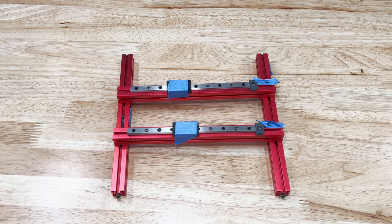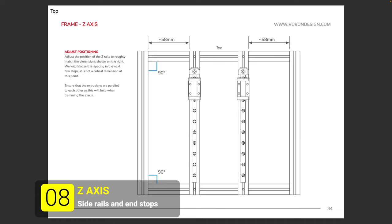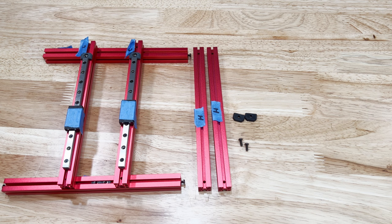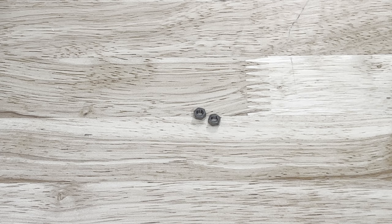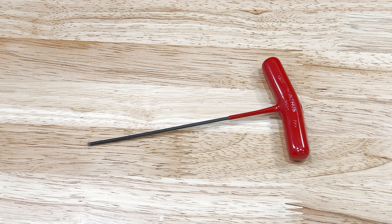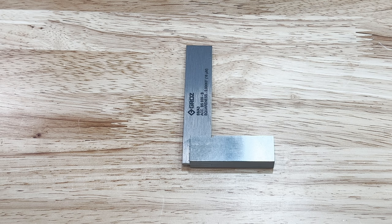It's starting to look like part of a frame. In step 8 we add the end rails and some end stops, and we also square everything up for the back of the frame. This step needs the Z axis assembly we just built, two H extrusions, two printed rail stops, two M3 by 8mm button head screws, and two M3 nuts. You'll also need a 2mm hex wrench, a flat surface to build on — it doesn't have to be a surface plate, but it's cheap and I have it — something to measure with, and a machinist square. This is a 3 inch 75mm one — my normal 150mm is just too big for this little printer.